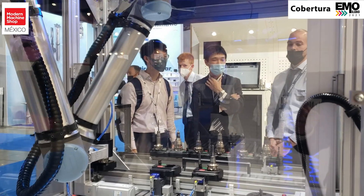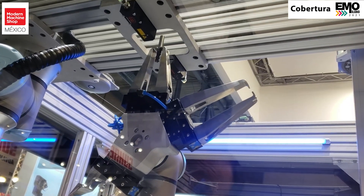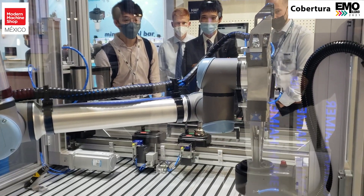We also have the new tool. There's a laser at the top of the machine. The laser is now measuring to confirm we have the right tool. It also gives you the gauge length of the tool. So once we know the stick-out length, it's going to exchange the old tool.